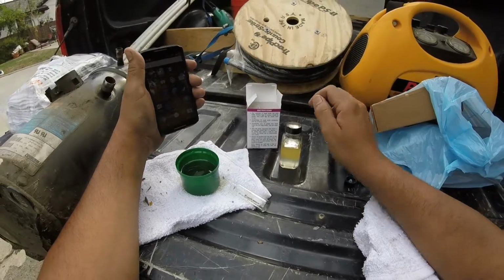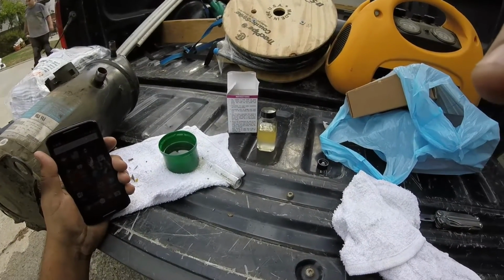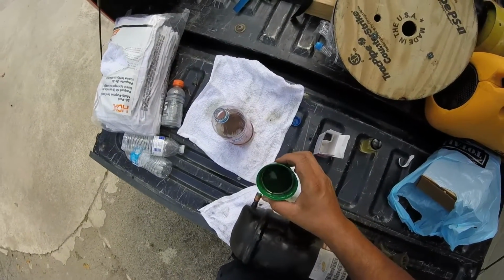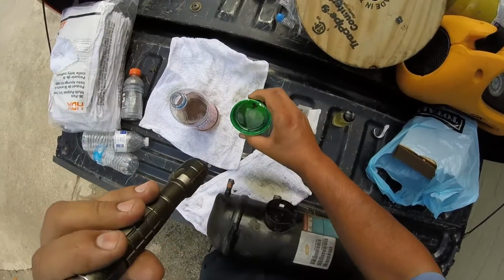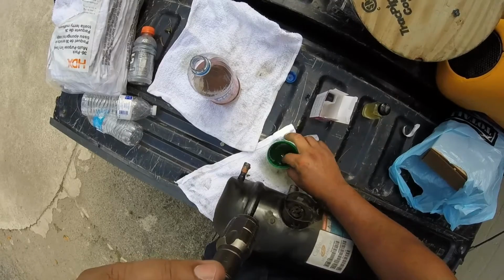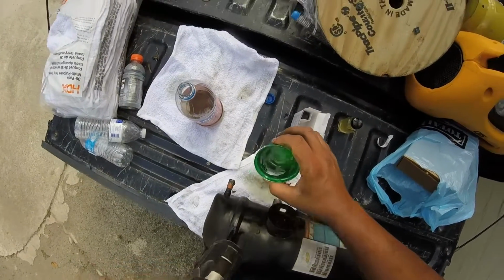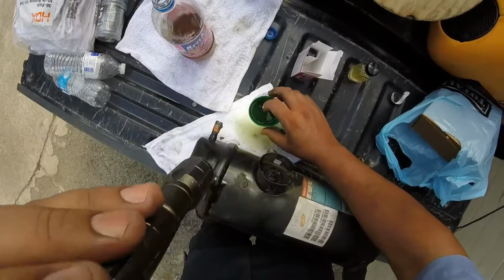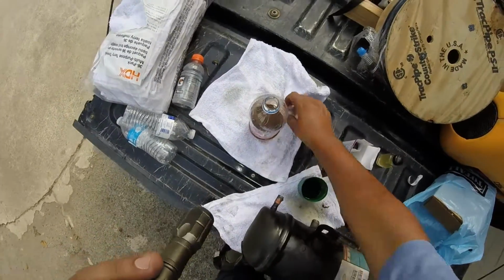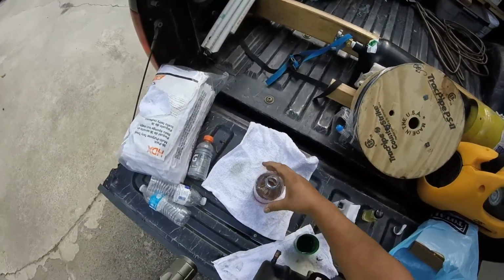Yeah, this has way too much acid. I would need to flush that line set out really good. So much trash in this oil, in this compressor. I don't know if you can see it. I don't know where this came from. So much trash. Gonna have to change the evaporator coil too.